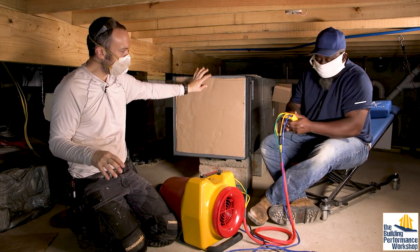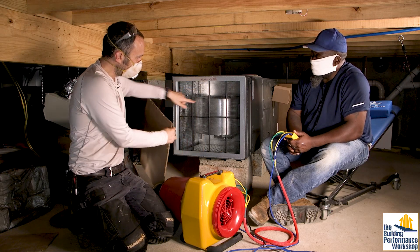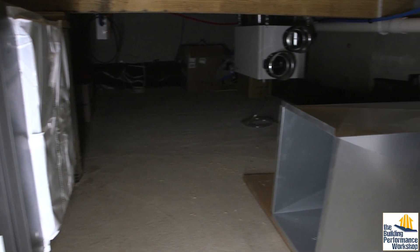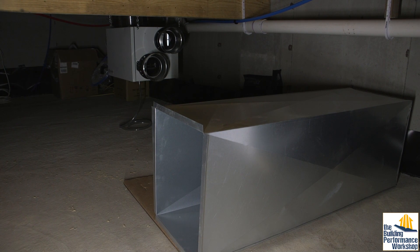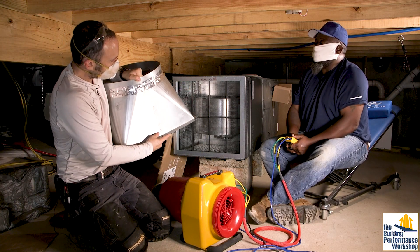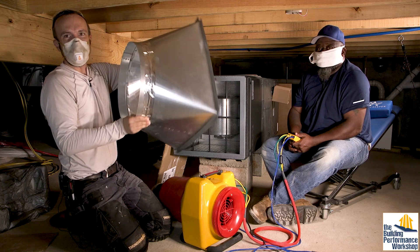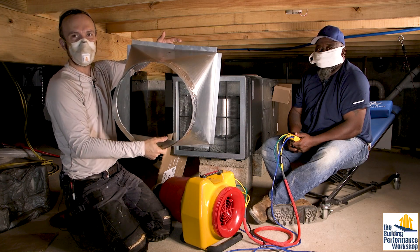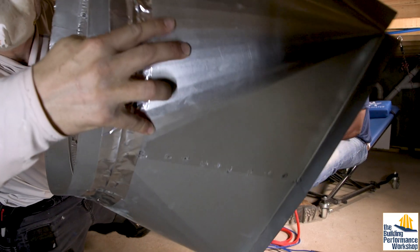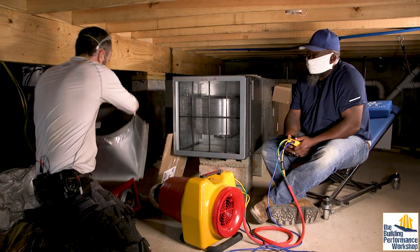The intentional openings are: one here — the return, where the blower is right there past this little fiber filter protecting the equipment — and then the other end sealed up before we put the plenum onto the supply and the collar on this. I've been spending a lot of time making sheet metal fittings — you can see another video of me testing the return plenum with one of our other Mastermind students. I'm glad I didn't try to replicate all the little folds they put into this. That's a lot of work.